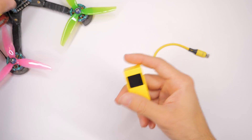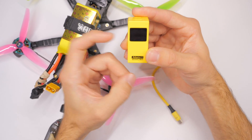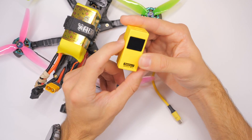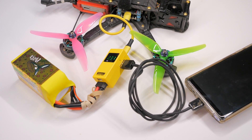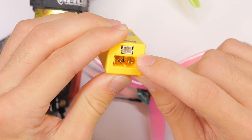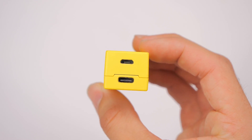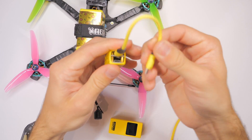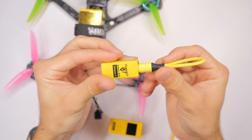This allows you to use the Speedy Bee app on your phone to access your flight controller configurator, usually Betaflight. They have some huge improvements over the Speedy Bee Adapter 2. This is the Speedy Bee Adapter 3, and you'll see this one has a screen. It looks like a really cool addition to your flight bag. It's $35 or thereabouts. It is a battery checker, it has a USB output so you can charge your phone or whatever else, and you can basically use your LiPo pack as a battery bank. It has a PH2 connector input for tiny whoop style micro drone batteries, and an XT60 for your standard batteries. It has a USB-C output or input as well as a micro USB output or input. On their previous model it was just micro USB, and actually one of the connectors didn't even do anything — it was just a dummy connector.